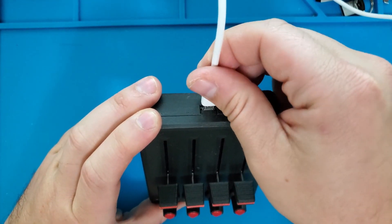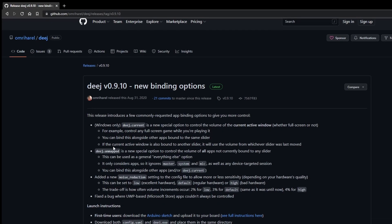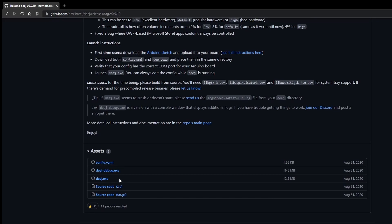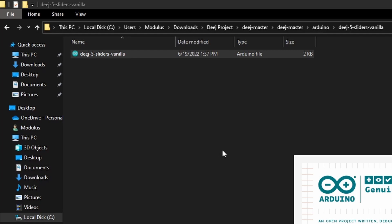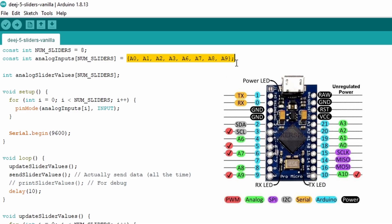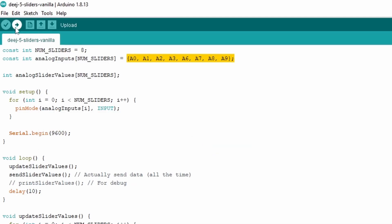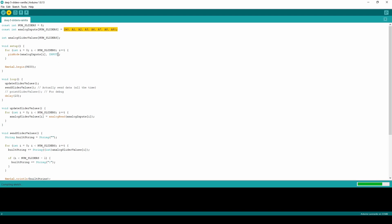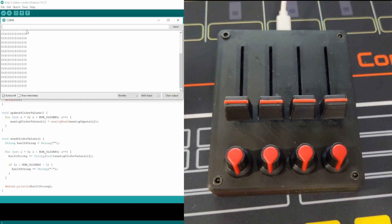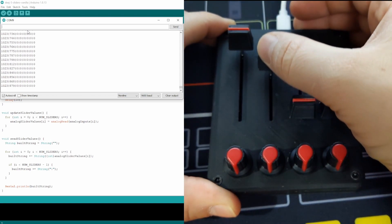Now it's time to plug the Deej in and get ready to program. First things first, I'm going to head over to the Deej project page and grab the newest version of the Deej project files and the Deej executable. After extracting those files, I'm going to start by opening up the Arduino project. Since my Deej has eight sliders, I'm going to make sure to change this first value to eight. In the second line, the analog inputs declared must match the analog inputs used on the Arduino Pro Micro. Next, this code can be flashed by making sure the correct board and port are selected in the tools menu, then selecting the upload button. After the device has been flashed, we can test it out by opening up the serial monitor from the tools menu. The serial monitor should display eight values that change corresponding with the position of each potentiometer.